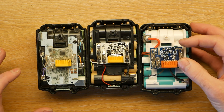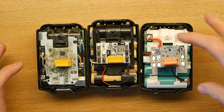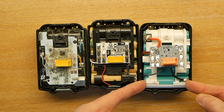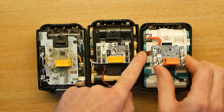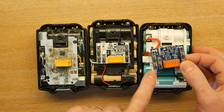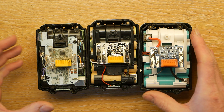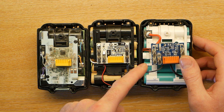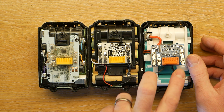So you may think that with a microcontroller on it, it's going to be doing some fancy cell balancing — but actually it's not. The wires going here are two wires of power; this one is connected to the first span of batteries, so that's only going to be four volts. And this is in fact a temperature sensor, and it's exactly the same on this side. The temperature sensor is not doing anything smart at all — it's just going between this contact and this contact. I imagine most tools are actually extremely basic and they just use that temperature sensor to cut off the controller.